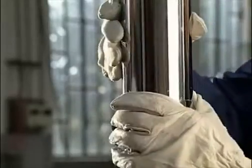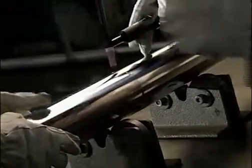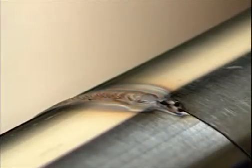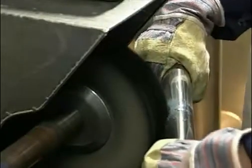These tubular handrails contain more welds than you might think. The stainless steel started off as a coil of flat strip, which was roll formed into a circular profile, and when the edges met, they were welded together to make a tube. The handrail was made by carefully lining up pieces of tube and tack welding them together. Sometimes a disposable sleeve is used to simplify the alignment. The main TIG weld was then laid down, with care being taken to avoid defacing the surface away from the weld. The heat tinting produced by the welding was removed when the weld was polished to blend in with the rest of the tube.